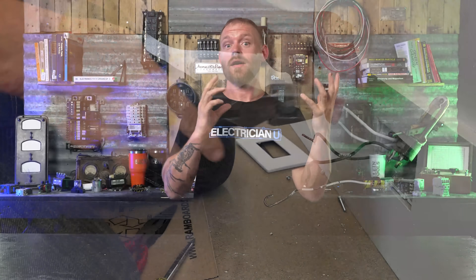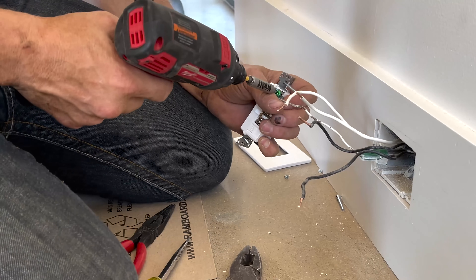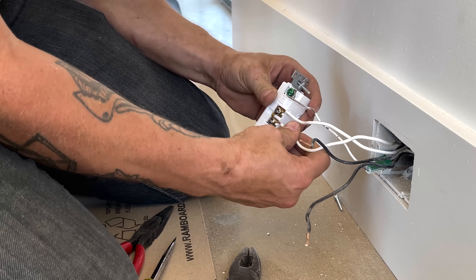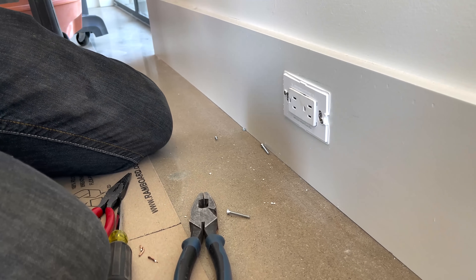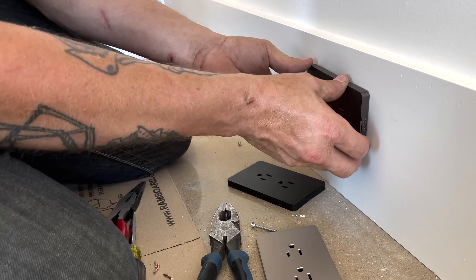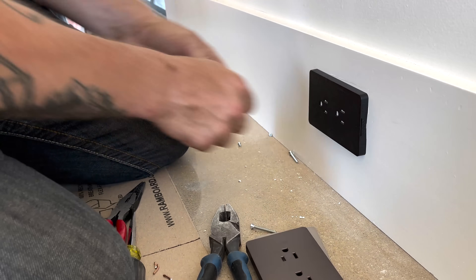The last thing I did was put XD series plates over the X-series receptacle. The X-series receptacle is similar to a normal one except the ground is reinforced and terminates similarly to how a hot or neutral screw attaches to the device — more rugged and located on the side instead of the bottom. The XD plate options are really cool too: you can choose any color — white, brass, silver, black. Instead of swapping out all the devices, you just swap the plates, snapping them right over the top to completely change the look of the place.